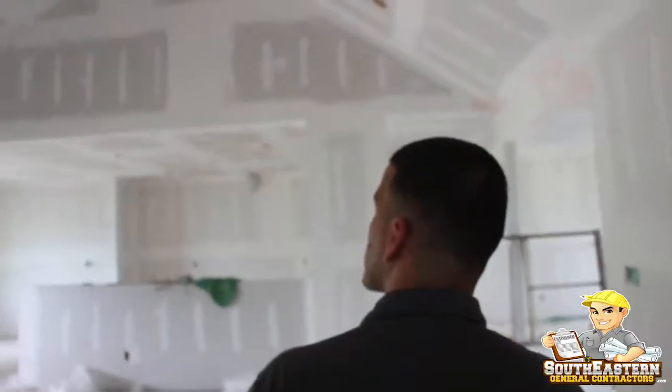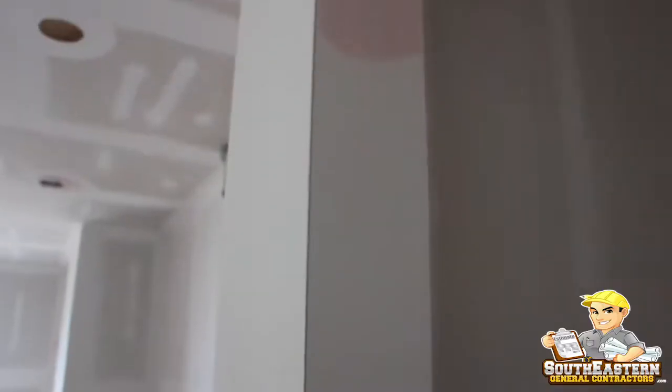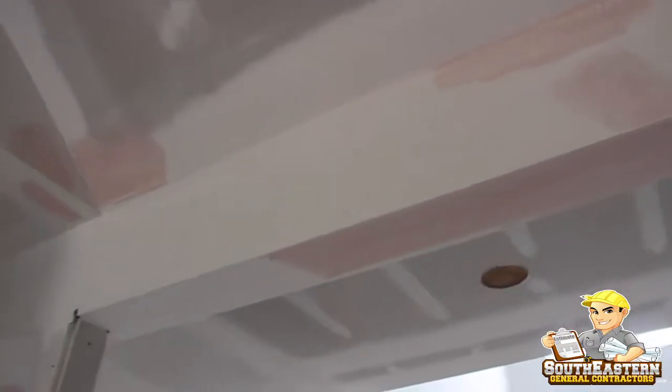As I'm walking through the job site, I'm very pleased with the progress being made and the procedures being followed. You'll see we've already started doing some point-up work. In that stage, we mix a little bit of red chalk or blue chalk into the drywall compound and go around with lights, starting to touch up any of the blemishes that we find during this stage.